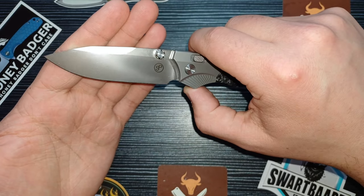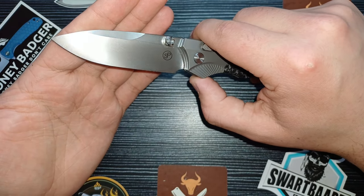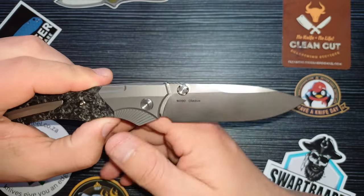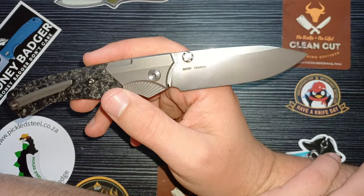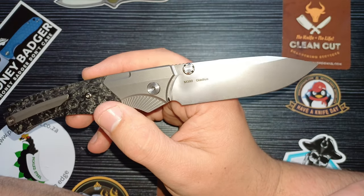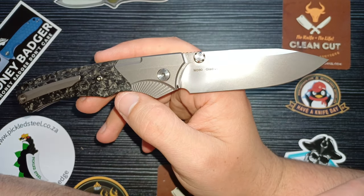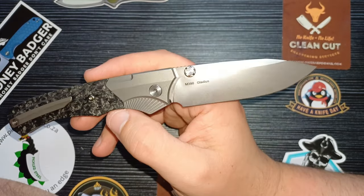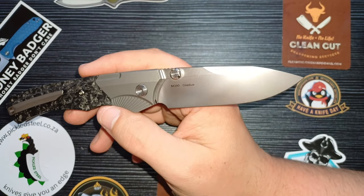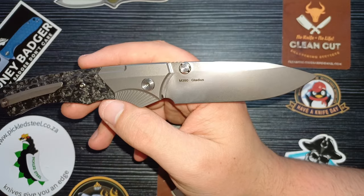There's a lot going for this blade shape and this grind. I love the M390 — it always appears to have a slight golden shimmer, just a hint of gold. It takes such a wonderful edge. It's a premium super steel with fantastic corrosion resistance. It's one of the trifecta steels — the Crucible counterpart is 20CV. Some people prefer 20CV but M390 is Böhler's version; they're basically the exact same steel, just from two different companies. The heat treat is critical with M390.